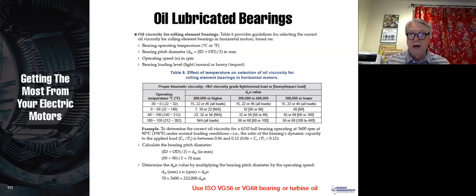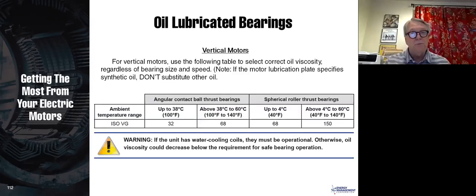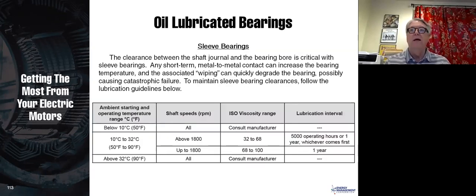This table in your booklet talks about how to select oil for the proper temperatures. It covers ISO viscosities and what temperatures those ISO viscosities are rated for. Sleeve bearings: I love sleeve bearings — they just tend to last forever; they'll outlive you. Sleeve bearings have a little brass ring that dips into an oil bath and lubricates the sleeve bearing. Temperature is very important, and the booklet will give you information on how to properly maintain sleeve bearings.